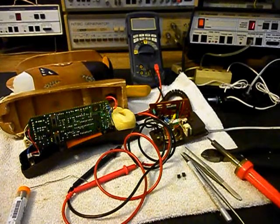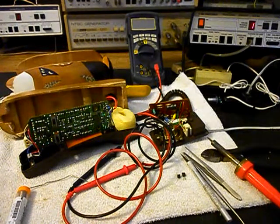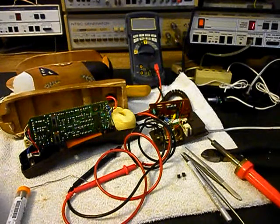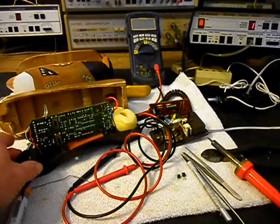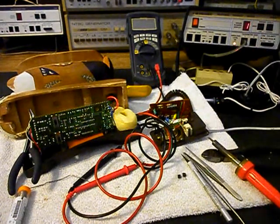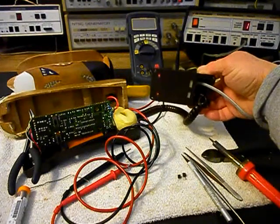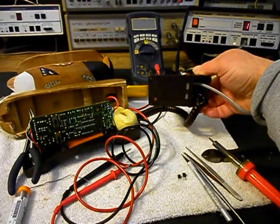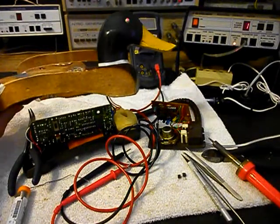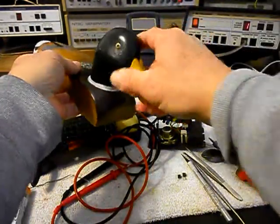We're back now and we're going to show a little bit about what's going on. We went ahead and troubleshot, found some components that we replaced. Now we want to check the ring cycle before we put this unit back together again. I want to make sure there's some weight on the hook switch. We're going to use the analyzer and start a ring cycle. We also want to show the duck's eyes are now lighting — before the duck's eyes were not lighting on a ring cycle.